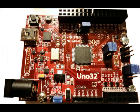This board runs at an operating speed of 80 MHz and is designed to run with Arduino code. In the first video, I was using the Accel stepper library and had it set up to run at 4000 pulses per second maximum speed. In theory, this 80 MHz operating speed is 5 times the speed of the 16 MHz Arduino UNO. So with this in mind, I changed my Accel stepper library code from 4000 to 20,000 pulses per second.